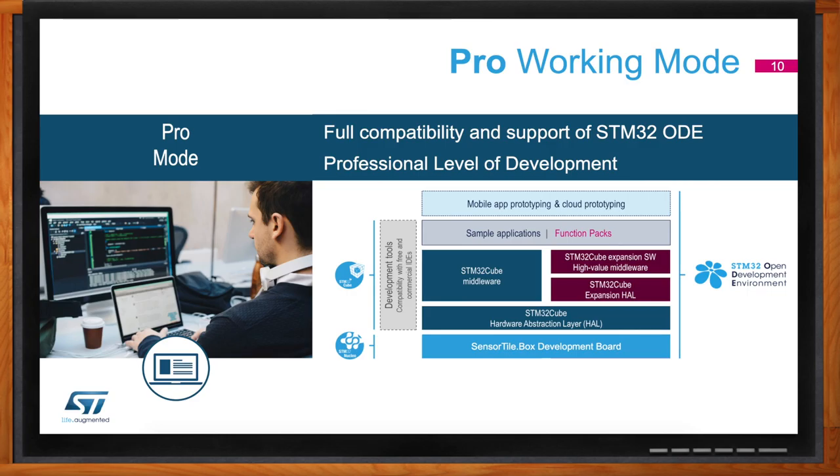So do you have any examples that are available? Yes, many examples are available. The easiest way to get them is by going to st.com and visiting the FPSNS STBox1 V1 function pack. This package gives you a wide range of examples which includes firmware over-the-air upgrades over BLE, low-power FreeRTOS implementation, a Machine Learning Core based on our IMU for activity recognition, and even simple things like streaming sensor data over BLE for data logging. It allows the user to have a validated starting point where your hardware baseline in terms of firmware is solid, and the mobile app experience is also available at source code level.